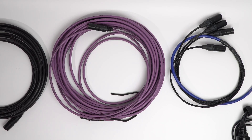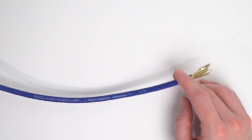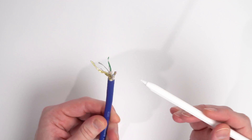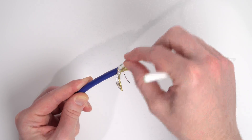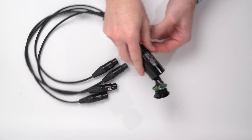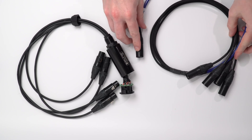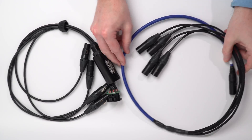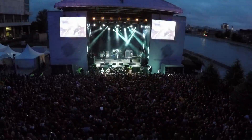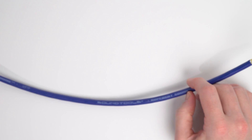The other cable you might have seen already is the SuperCat Sound cable, which is distinctly blue and only available in blue at the moment. This is also a Cat5E cable, but in a UFTP construction — meaning no overall shield, but each twisted pair has its own foil screen and individual drain wire encased in a layer of mylar for isolation. Those individual drain lines mean each twisted pair can be directly wired to an XLR connector, which is how they were able to go from the original CatTails design with a machined housing and PCB inside to making the SuperCat Tails with just an RJ45 wired directly to the XLRs. This cable is incredibly rugged, though certainly a bit stiffer than the original SuperCat. It was designed specifically for Rat Sound to use on tours like Pearl Jam and on festival stages like Coachella, and feels similar to Whirlwind's blue-jacketed snakes in how hard and durable it is.